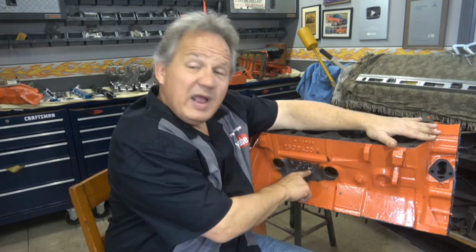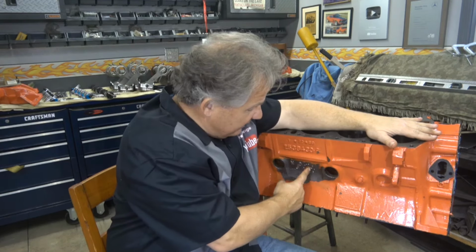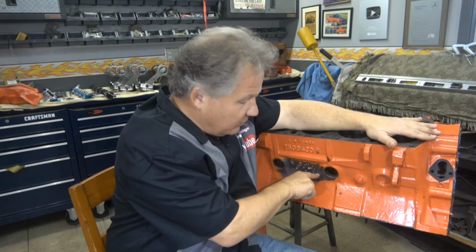And where this crack is, and where it sits so close to the center of the cylinder, that crack right there being the most narrow portion, my guess is that there was still some water left in there somewhere. It was left outside, and up here it gets really cold. It froze, and it put a crack in that block. And that crack was probably really small on the inside. It probably started to crack. And when it was magnafluxed, even if there was a small crack there, it probably would not have been seen.